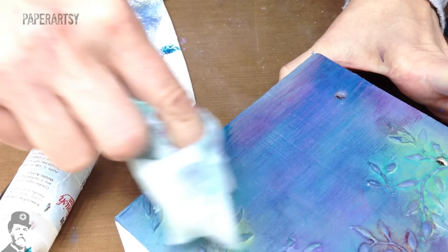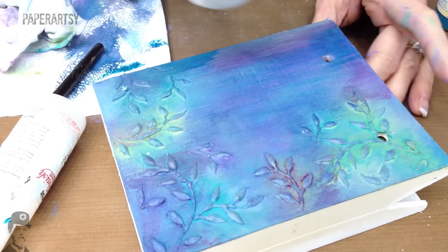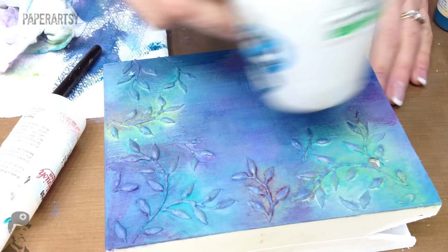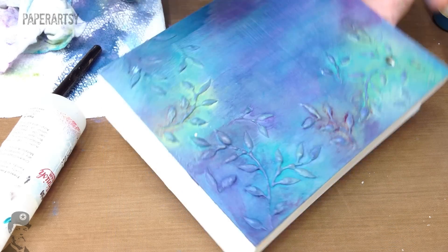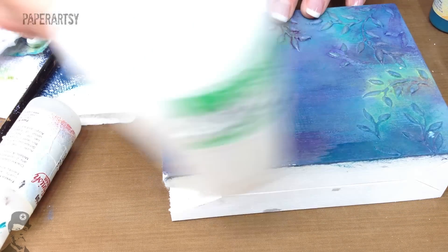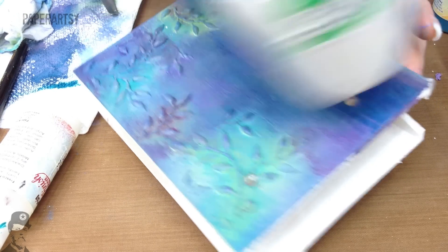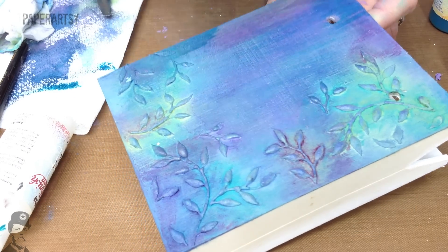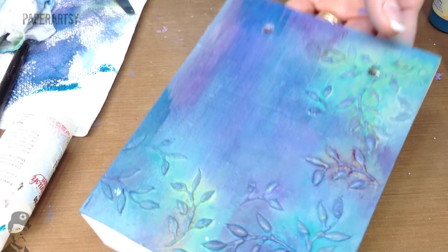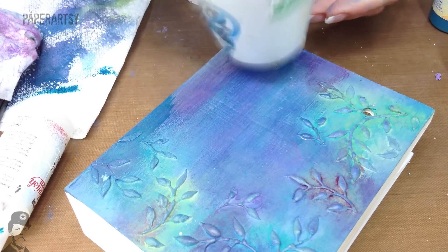I'm just going to remove the little bits of crackle off the texture. It's really important that we dry the crackle glaze properly — it's quite thick, so it does take longer to dry than paint. Go easy with your heat gun; if you're a bit close or hold it in one place for too long, it will blister the glaze. Be a bit patient and just wave it over the areas — the shiny bits are the last bits to dry. If you've got shiny bits that aren't drying, you can come back and remove them with your scraper — it won't affect what happens next.